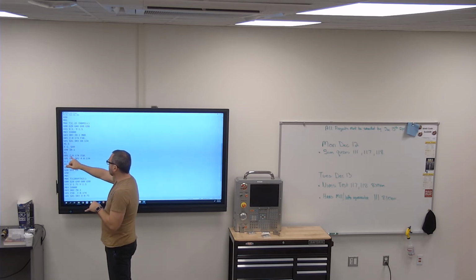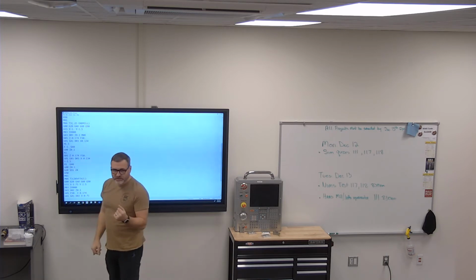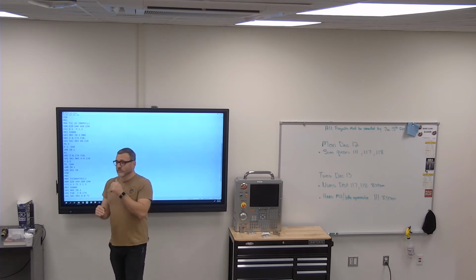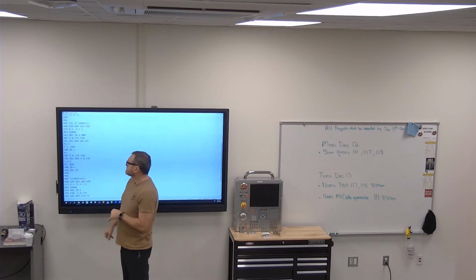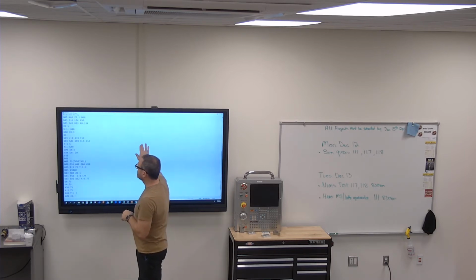Then you position over here, you get a Z move, then a G1, G41, D3, cutter compensation on again. It does its move, turns it off again. It really does a little short. So after the Y 1.5, X1, G64, G40, it'll be off by then, right? Yeah, that turns it off.